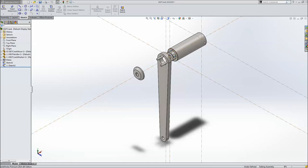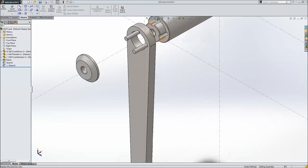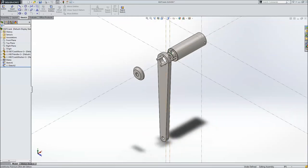boss, undersized boss. And then I was thinking about using this kind of an unusual technique for me, something I haven't done, which is this Scotch key, I think it's called, this round key. I've never done this before, so we're just going to give it a shot. I could just come in here with an end mill and cut a straight square key and slip a square key in there and be fine. If this doesn't work out, then we'll probably end up doing that. But I just thought I'd give it a try.